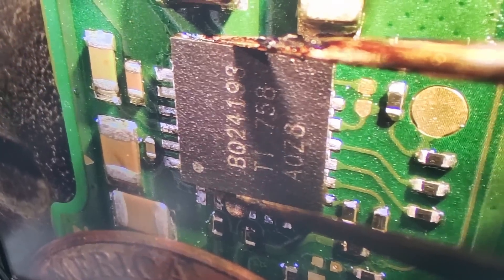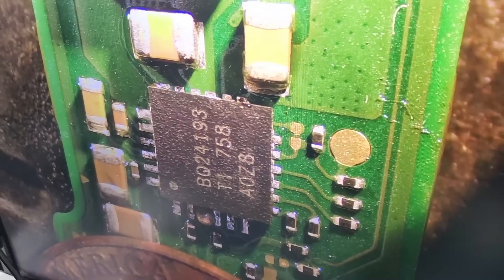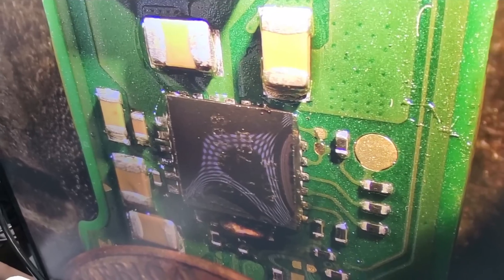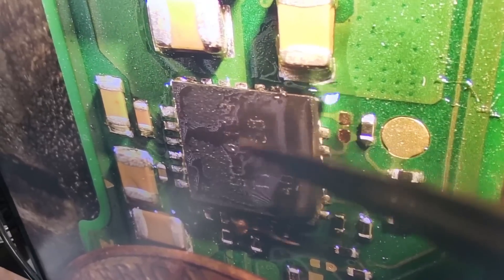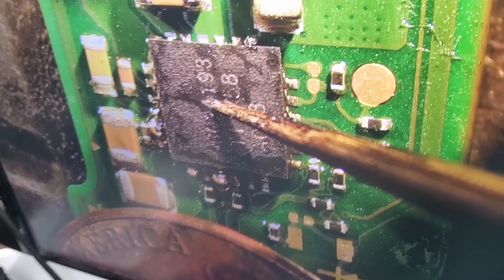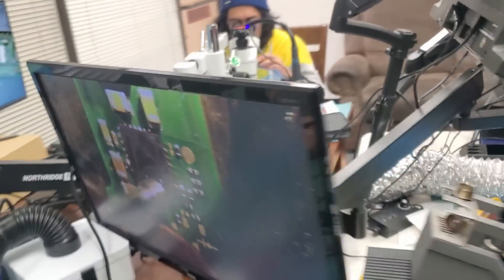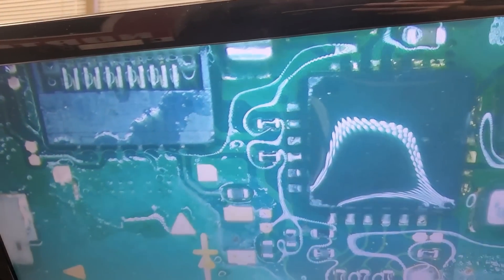Go for it. Try to keep your hands steady — good. Let go. Now you want to reflow. Add some flux, and when you reflow you can tap it a bit from the top. Always before adding flux or doing anything, make sure that solder has cooled down and hardened. Push down. You see, because you had a lot of solder in the center they squeezed out. Very nice. That looks amazing — awesome!